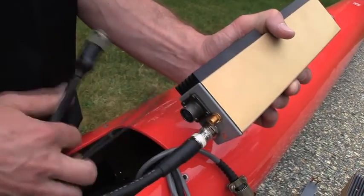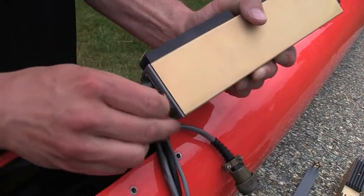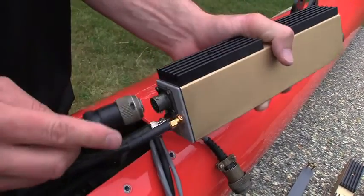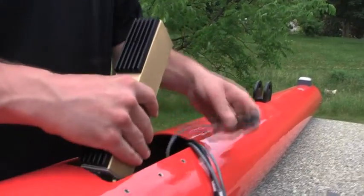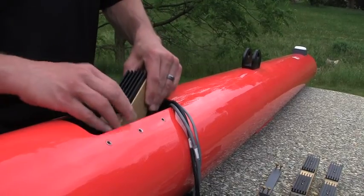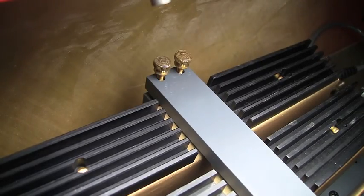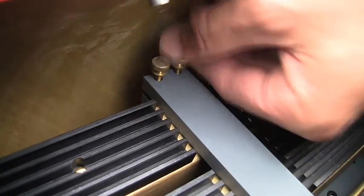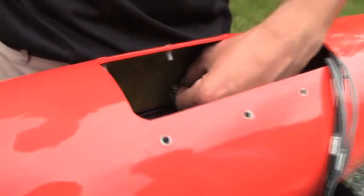Connect the signal cable, the RF cable, and the six pin control cable. Attach the power cable on the other side, which will also be marked, and reinsert the electronics box into the tube. You will need to repeat this process three times. When the magnetometer electronics boxes have been repositioned, they are secured by the plate and the screws, and are fully firm within the fuselage.